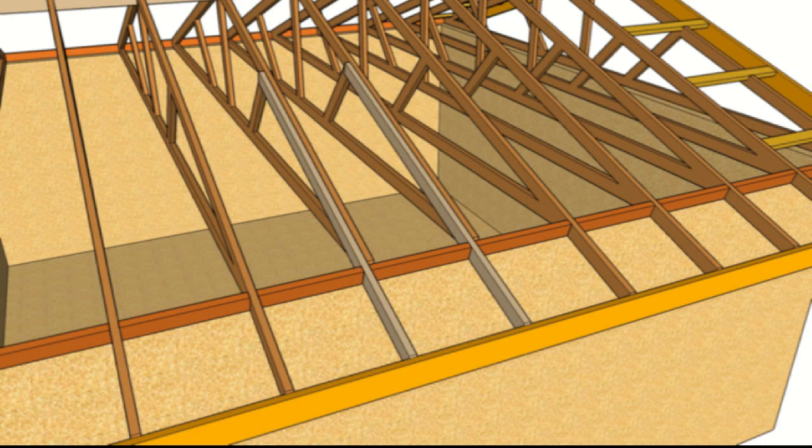After you install the rafters, you can recut new blocks. The blocks will be different sizes since you are moving the rafters. In a case like this, on 24 inch centers you'd normally have a 22.5 inch block, but now you're going to have a 21 inch block, a 22.5 inch block, and a 24 inch block. You'll have one rafter that's a little over-spanned, but when it's all said and done you should be able to pull the sag out of the fascia board and the overhang.